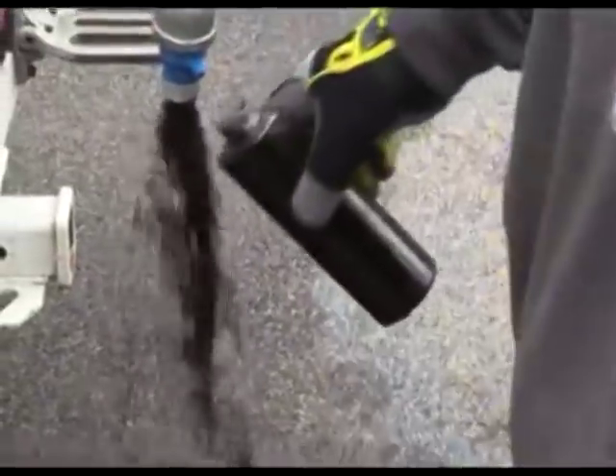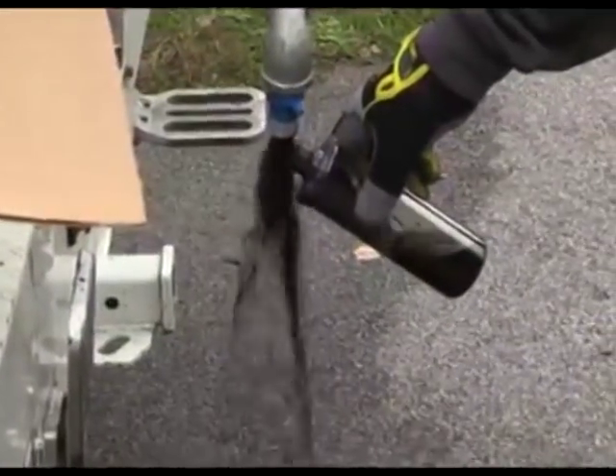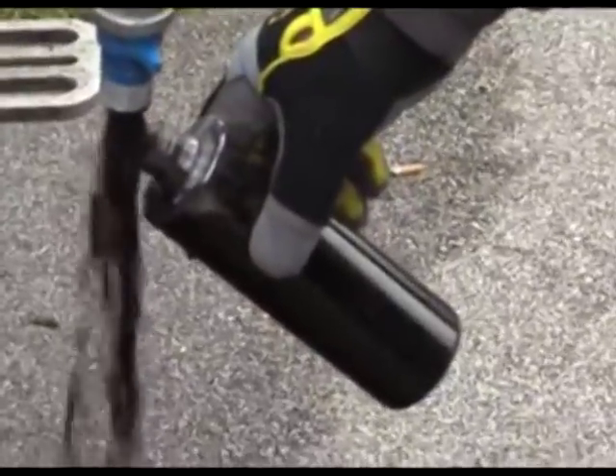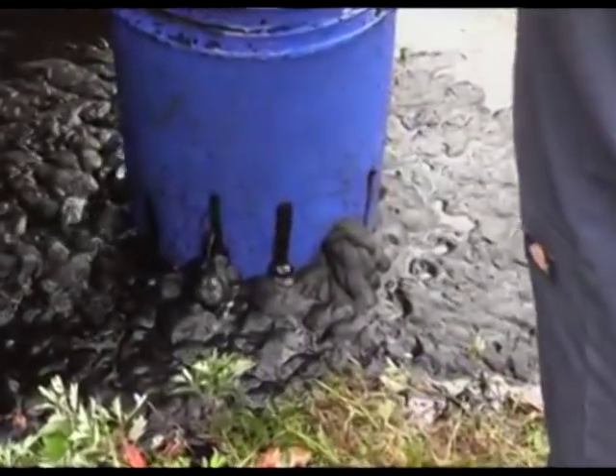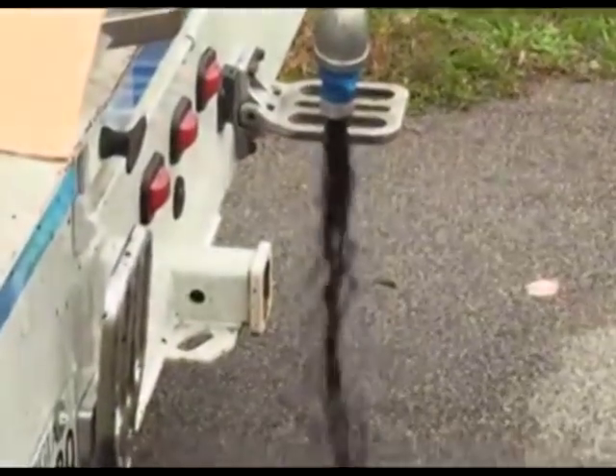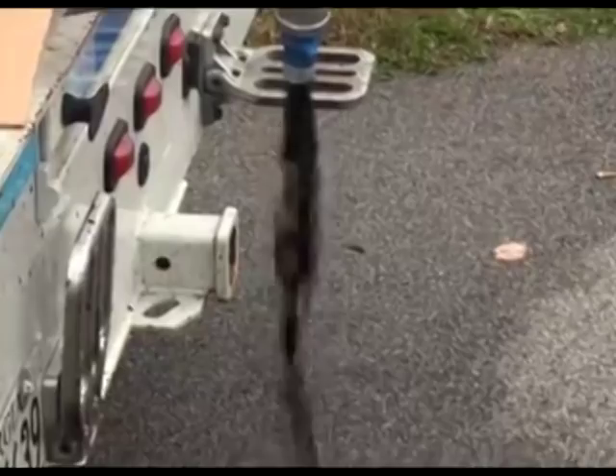That's the discharge water being let into the sewer so that we can clean it up. You can see it was very successful in removing a lot of material from the pipe. We can tell by the color that we're getting a lot of manganese out of that pipe. You can see now that's the ice ball, which is basically full of manganese and all the material that was on the side of the pipe, coming out now.